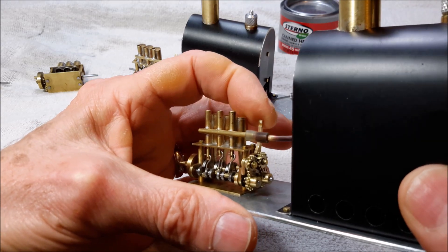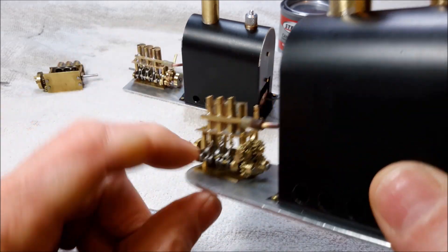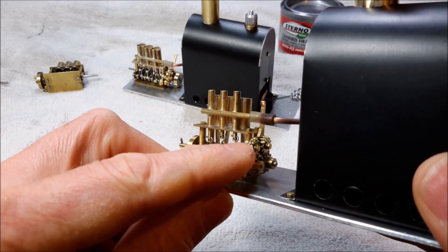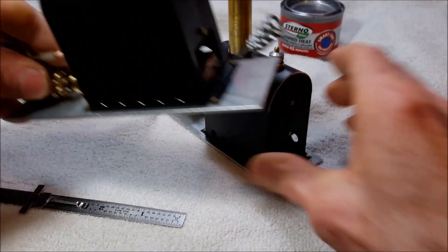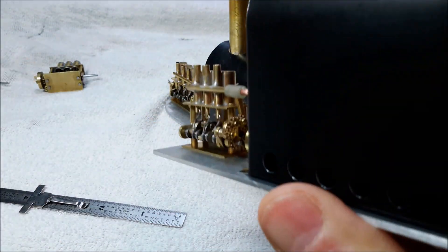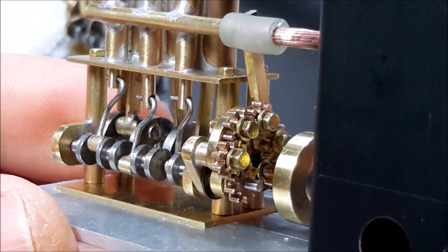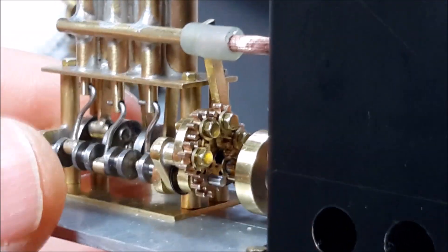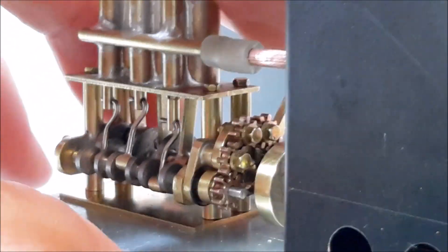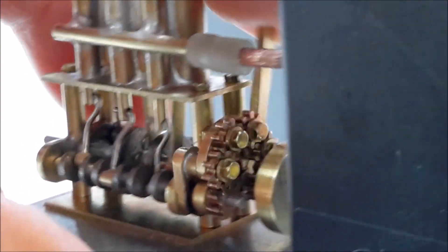The shifting gears on the top have to have an even number of gears, otherwise it won't work. So this one here has the two larger gears. And this is a variation right here using much smaller gears — this one has four gears on the top and it has the flywheel on the front. But it does the same thing: it rotates the valve shaft with respect to the crankshaft 180 degrees.